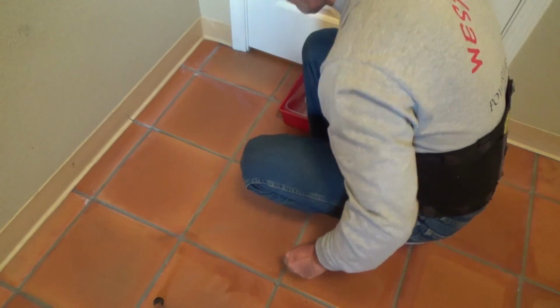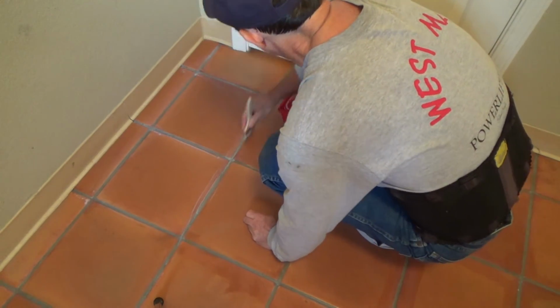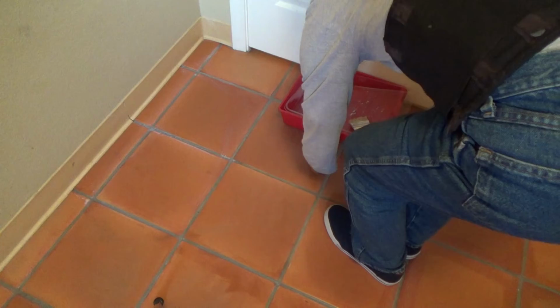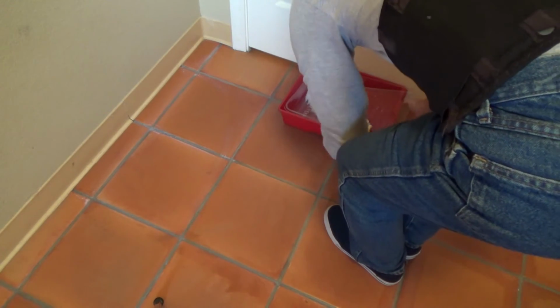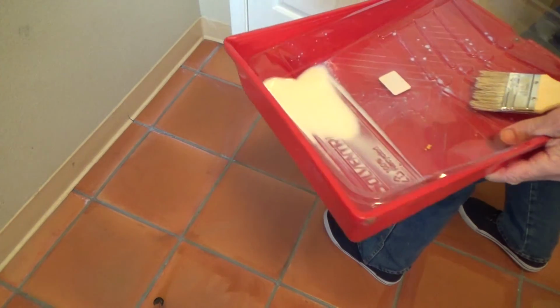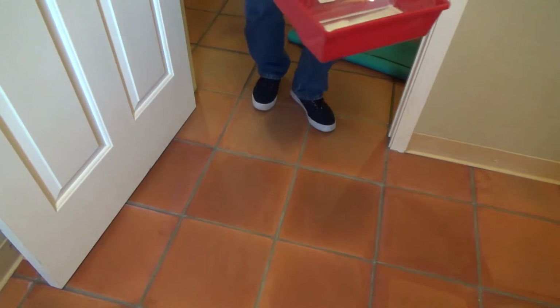The key to Simple Green, and most people don't know it, is you kind of brush it on there, and you let it sit. Gotta let it sit for, oh, I don't know, 10, 15 minutes. And then I go back after that. That's when I do the real cleaning. That's when it starts working. You know, it doesn't start working right away. If you do it right away, you only get so much, and you think, oh, this isn't working, this is no good. And it is good.